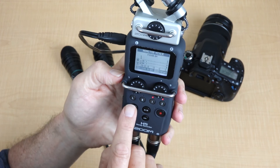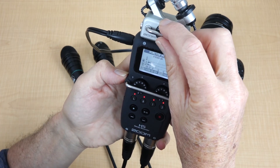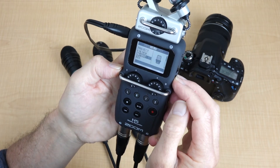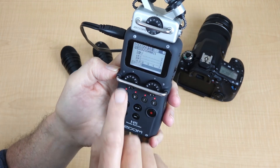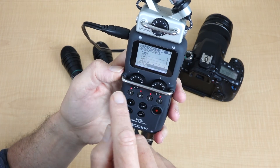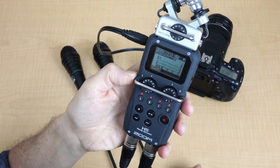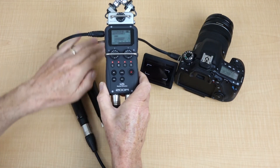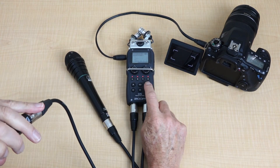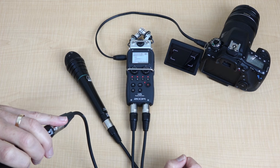Let's liven up these top two microphones as well. I've livened up the two top microphones, and you'll notice straight away that they're not indicating on here — so that's not a problem. We'll go back to the main ones. Not only do the two XLR microphones show up now, but now we're out of the mixer and you can see the H5 definitely sees these microphones as recording. So once we've got that set up, we can do a test recording. We grab one of the microphones, press the record button and it will start recording a file. We have a listen to it and then check that it's nice and clean.